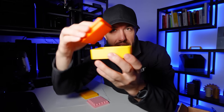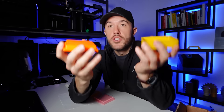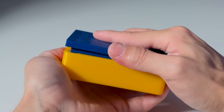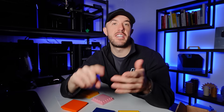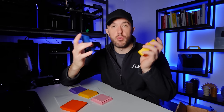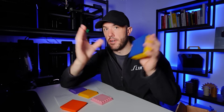How do you make sure something like this fits into something like this perfectly every single time without having to worry about any of the slicer settings? In this video, we're going to talk about how to do that in a couple of different ways. It's really important to make sure that your tolerances and clearances are all right when designing parts that fit together. This can be challenging because changing the color of a material will actually change how much it shrinks and how it fits together. It will also vary based on your machine, your settings, your infill, your nozzle size, and your resolution. All of that will make things fit together differently. So the best way to get around this is to design the parts to be really robust so that it does not matter what slicer, printer, or material you're using — everything will just always fit together perfectly.